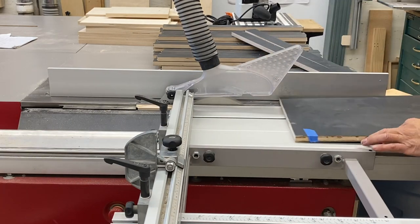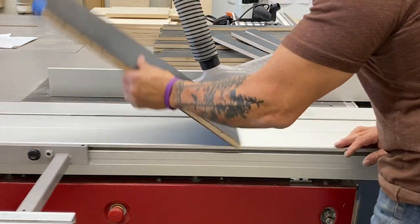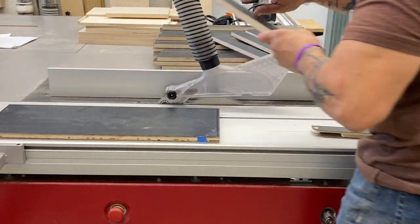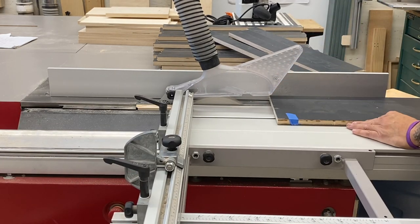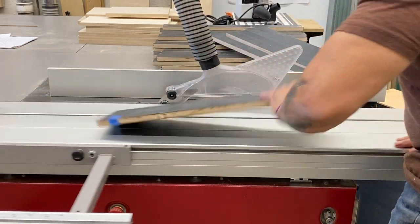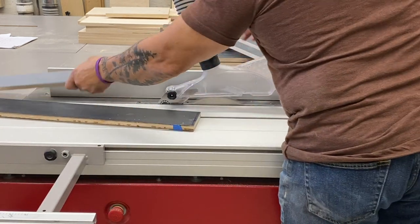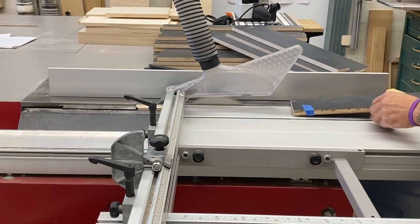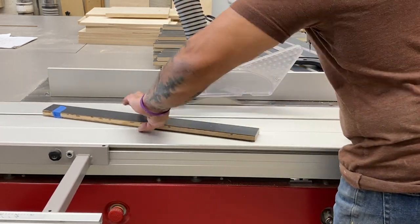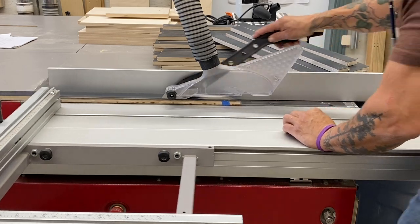Here's something interesting: I'm making zero clearance inserts, and I'm making a cut then flipping the board over and making another cut. What I'm creating is a board that has one edge that is super clean and one edge that is chipped. The reason I'm doing this is because yes, I could use a scoring blade — however, phenolic or plastic laminate is brutal on a scoring blade and will dull it in no time. By doing it like this I can eliminate using a scoring blade, and I'll show you why in the next clip.